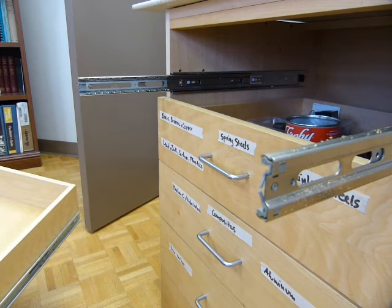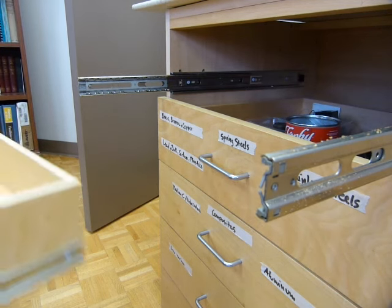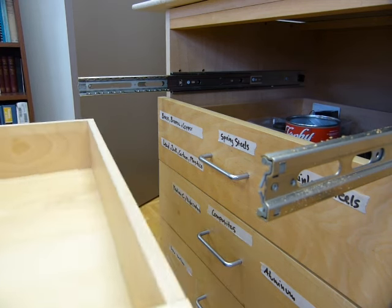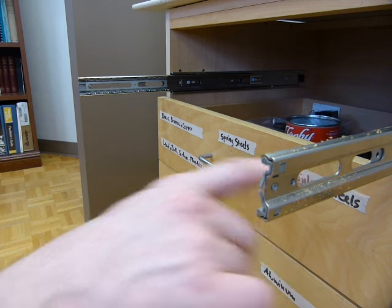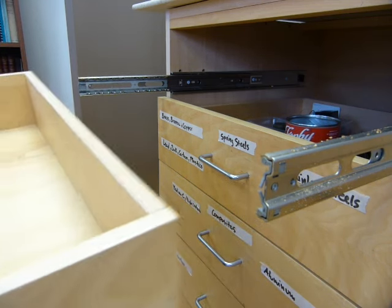Here's how you can make this neatly aligned. It's important that the two sides be aligned and the drawer advance squarely, not skewed. So extend both of these — extend this steel ball assembly here all the way to the end.